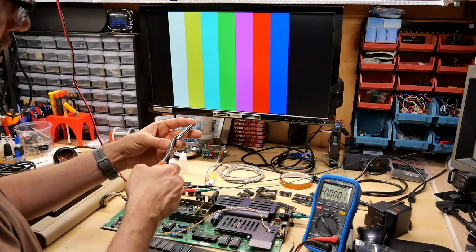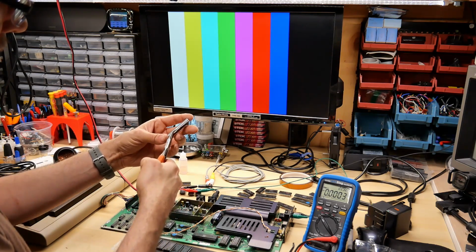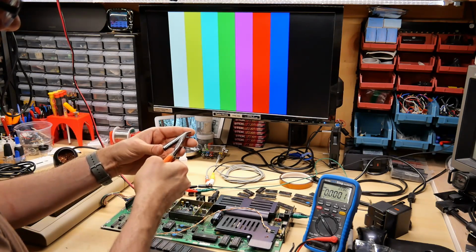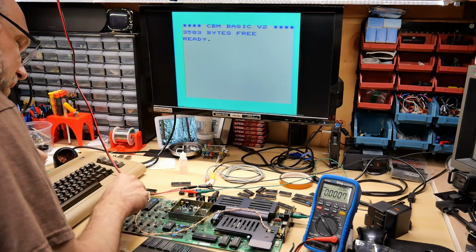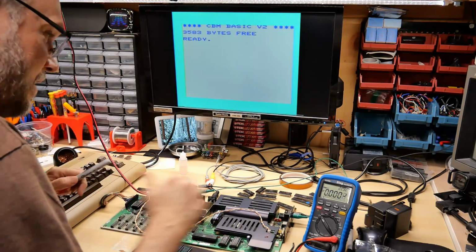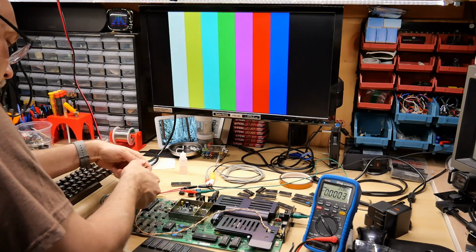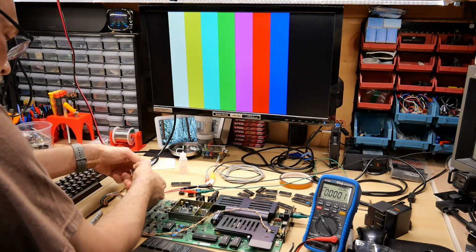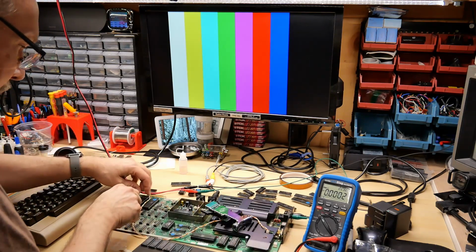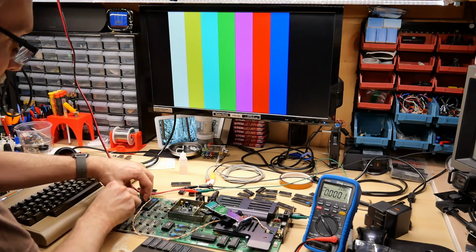Okay, this one's been desoldered from a motherboard. The pins are straight, except for the area at the end, they're kinked up. So I'll just use my needle nose to go through and straighten these out. Okay, so this 6526, no flashing cursor, which is a sign that it is bad. So I'm just going to pop this out really quick, make sure that I didn't bend a pin putting it into the motherboard, because, okay, see, I can't get it out with this tool. Kind of pulled it out partially. I'll use my chip lifter for the rest.